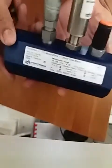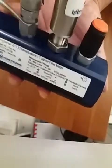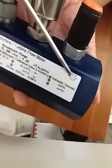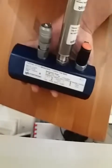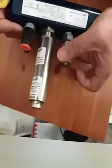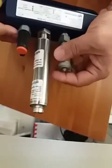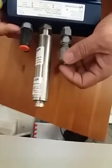When you install this flow meter, the direction is very important. It says one side is the inlet and the other side is the outlet — you must follow that to measure the right flow. There is also a test point connection where you can check the pressure.